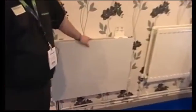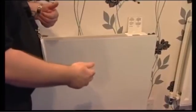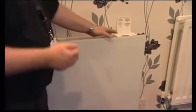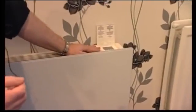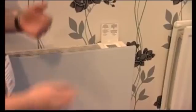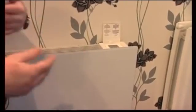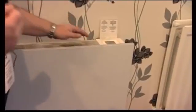That will bring me on to the smart rad. This is a fantastic machine — it will give out the same amount of power as a conventional radiator three times its size. It will warm a room in less than a minute if it's sized correctly, and it has very low running costs, which means we can run it at the same temperature as underfloor heating. So it's a brilliant alternative to underfloor, but it can also work with underfloor, giving you one flow temperature at the most efficient running temperature for the heat pump.